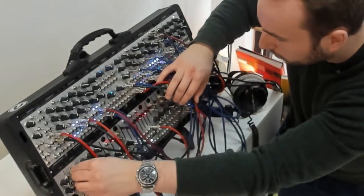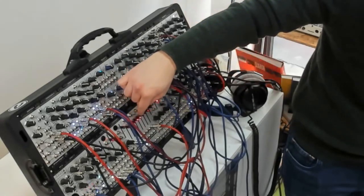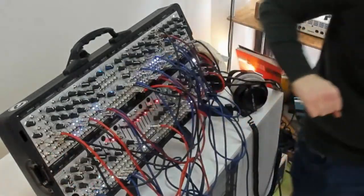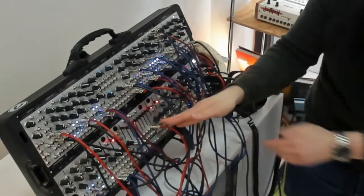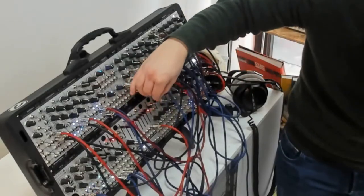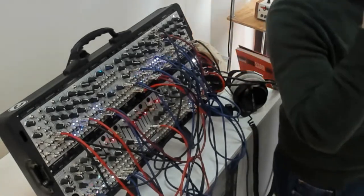Maybe if I slow things down a little bit. And so now every output will actually track the inputs, and you see the oscillations change. It keeps following whatever is on the input, and sending it to the output of the active stage. You can also go to sample mode, and then just 1 sample is taken the moment a stage becomes active.